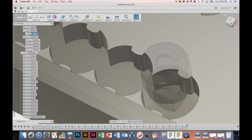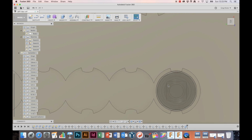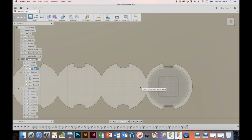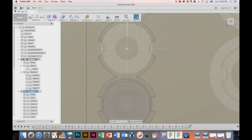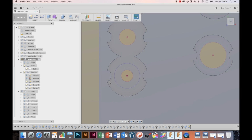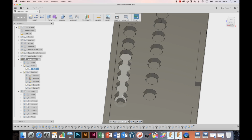Back to our friend, the square adapter socket. It's the oddball in that it has the square piece that actually we invert this socket in the box so that it'll sit right because it has a lip in the wrong place. So I need to create a recess for the square adapter to drop down into. So I'm creating a circle sketch. We're going to turn that back on, and then you'll see I'll whip up into 3D here, and we're going to grab that circle sketch, extrude it down. I can't remember the dimension there. Maybe it was 1/4 of an inch or so, and that provides a recess.